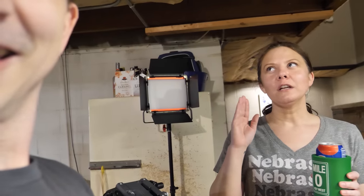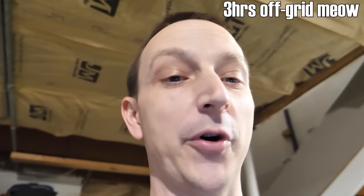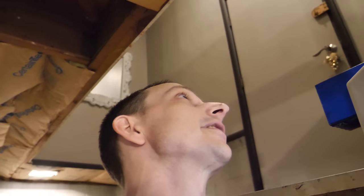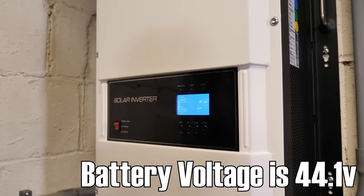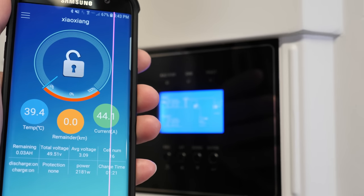Time is 3:40 PM. I'm going to switch back over to the grid to simulate the rolling blackout ending and the grid coming back. Battery voltage is down to 44 volts, so I'm doing that now. We're back on grid power, recharging at 43 amps. We were really close to the actual cutoff — I just didn't want everything to shut down.